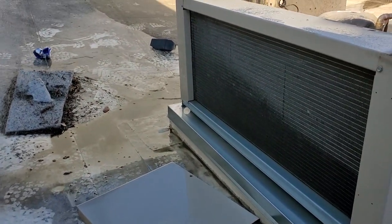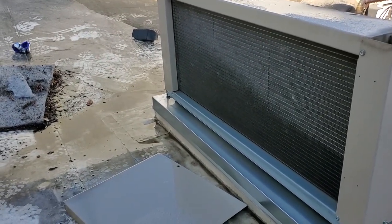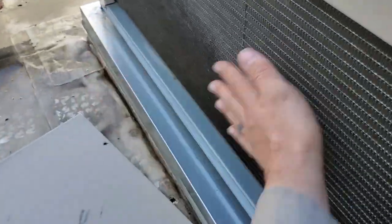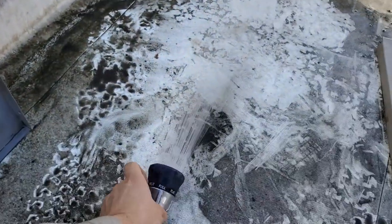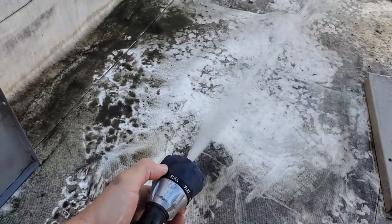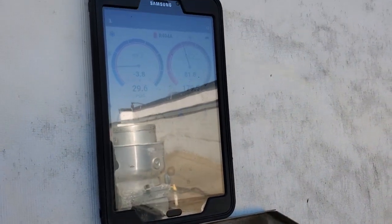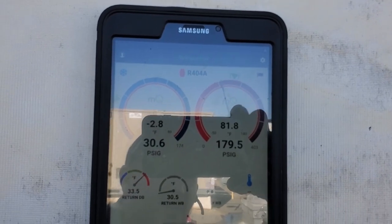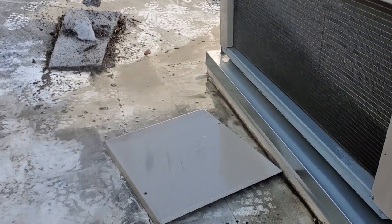As we pull the water off, the evaporation effect will start happening. At one point we drove the head pressure all the way up to 190. It's very easy to saturate a microchannel because of the small openings for air to pass through. In the summertime on a 410A condensing unit, you can actually trip the high head pressure control by turning it on right after you cleaned it — that's why they tell you to tap the condensers. It'll take a few minutes for the evaporation effect to kick in, or I can just tap it and get the water out. It takes a very long time for water to come out of a microchannel.